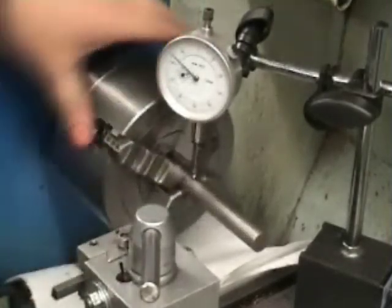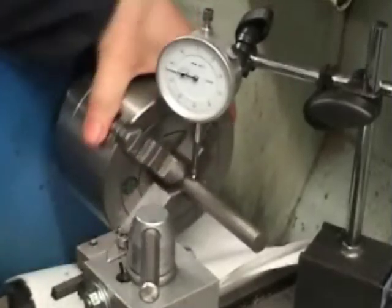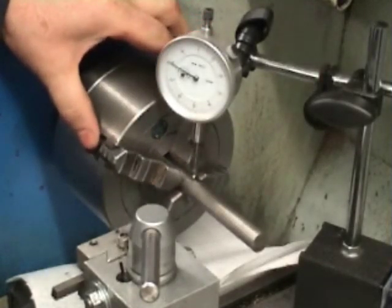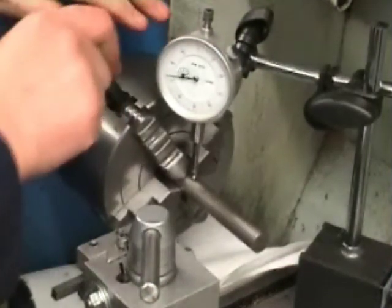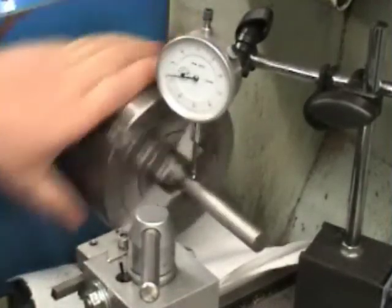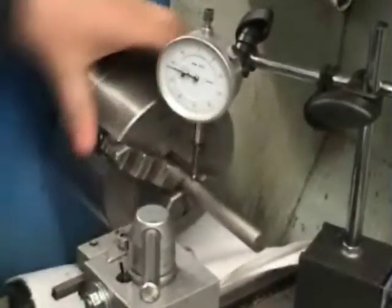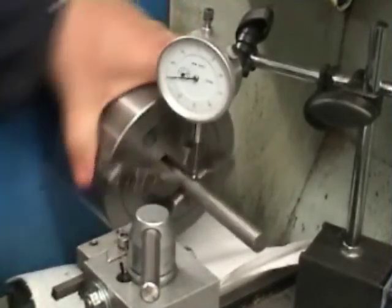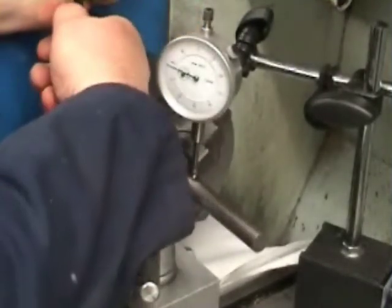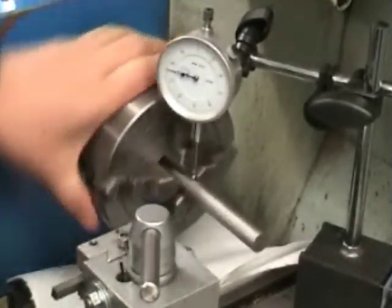It's a bit better. Go to the high part again, which is number one on mine, so we need to release number three a little and tighten number one down. Now you can see we're getting a little bit better. Find the high spot and this time it's between two particular jaws, so all we do is the opposite: we loosen them up a little, not too much. Now it's getting closer. Tighten the two that were showing high. Check again — those two are slightly high and we may just get away with tightening them because they're already loose to begin with. I always just check that the bottom two are tight first.